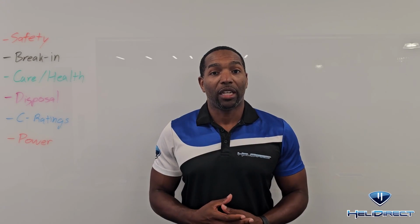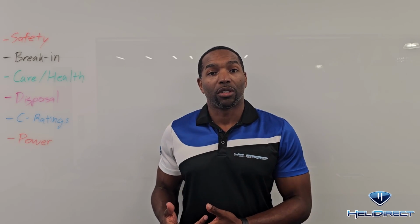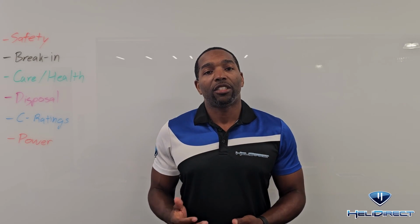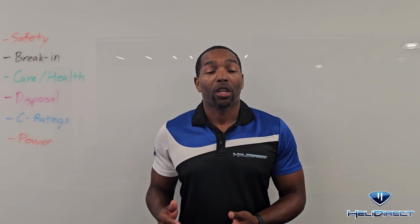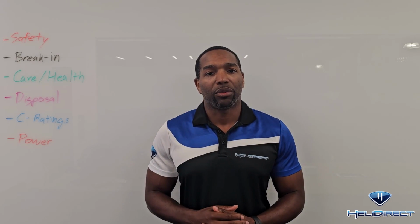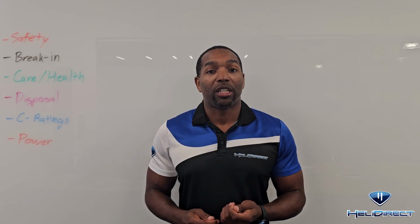Let's talk about care and health of LiPo batteries. General rules of thumb apply here. Don't overcharge the battery beyond your manufacturer's specified voltage. Don't over-discharge the battery below 3 volts per cell, and when not in use, keep the battery voltage at around 3.7 to 3.8 volts per cell, or storage charge. Don't let the battery become excessively hot. Try not to use more than 80% of the battery's total capacity, and never charge the battery unattended.